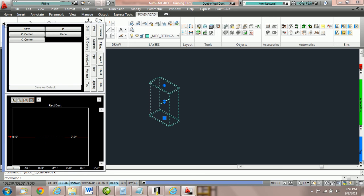So let's hold this open for a minute. Notice right here that we've got the in node and it's at 9 inches. What happened was we rotated the duct up, so now the bottom is no longer at 0. So if we want the bottom of this duct to be at 0, now we actually change it. And now the duct's bottom is at 0 foot 0 inches. And you can see by the square blue node, we're holding the in joint.